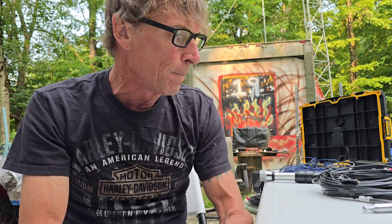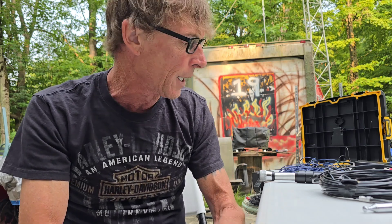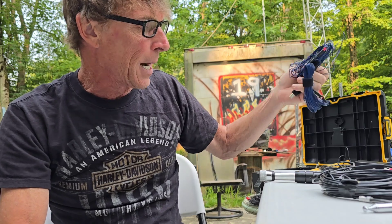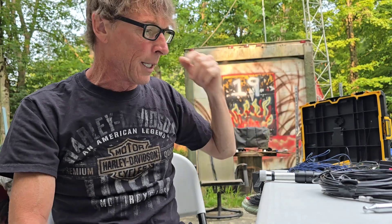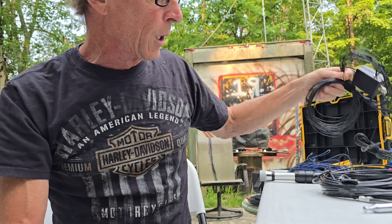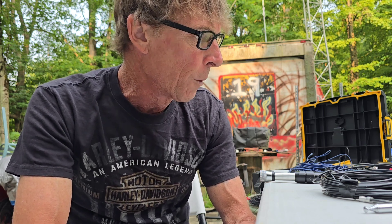All in all, if you're wondering what kind of antenna you should get, there are so many options. This is a 40-meter dipole which works fantastic. This is a 20-meter half square which works really well and gives you directionality and beam-like gain. With verticals and wires, it's all about experimentation. Even though one may work really well one time, it may not necessarily work all the time. Don't believe all the hype as far as these telescopic verticals go - I'm skeptical.